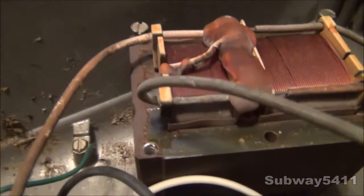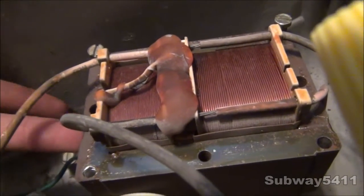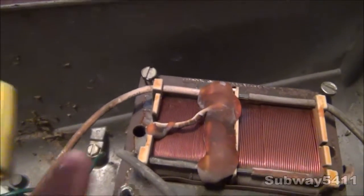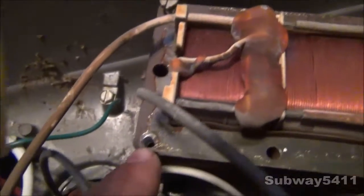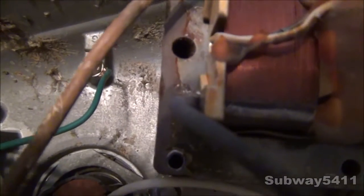We have a clear bulb in there. I really like clear mercury vapor bulbs — you can really see how it works. Now, this caster bulb is not good quality at all, but it was kind of all I had at the moment. Inside, we have this ballast that came out of a streetlight with a broken case. I salvaged the ballast and numerous other things, and that's the ballast I'm using here. This ceiling has two screws in it. These other holes I cannot put screws in because this ballast had a bracket on the bottom with rivets, so I had to drill out the rivets.